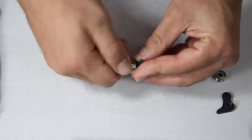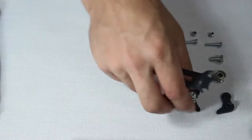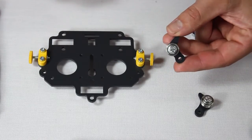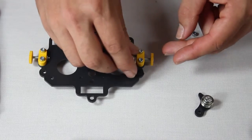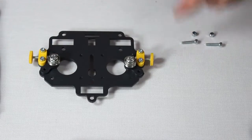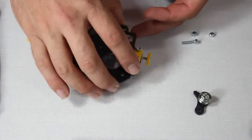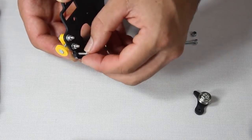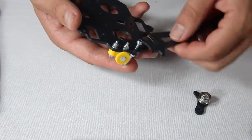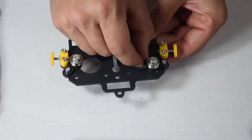Screw in the bolts by hand, then tighten them well with the spool holder. Repeat with the other pieces. Now we'll fasten them to the previous piece. Be very mindful of the orientation and consult the manual to be completely sure about it. Screw it on as shown, and take note that this time you don't need a washer. A correct end result corresponds to the pieces swiveling freely.